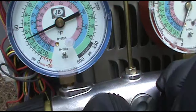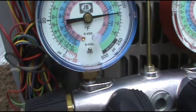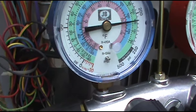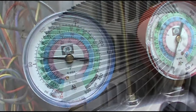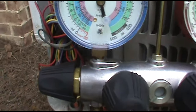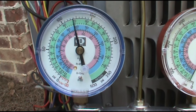That's all it was — she just needs some juice. I'm not gonna get too crazy about superheat or anything because it's just gonna leak back out. The unit is running again. I'll leave it right about there. We're gonna do a leak check — this is just an end-of-day temporary fix to get them cooling through the night.